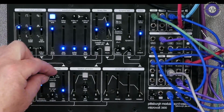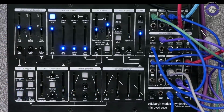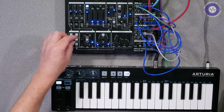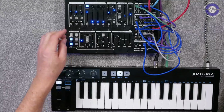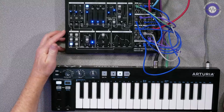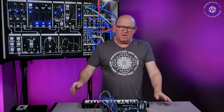But we also got the blend between the LFO and this random generator, which is getting its clock from the output of the Beatstep Pro. And it's kind of useful because it gives us that random. If we get the arpeggiator into play as well, you can clock the arpeggiator off the random generator and get all sorts of interesting and unusual, almost self-generative patches.